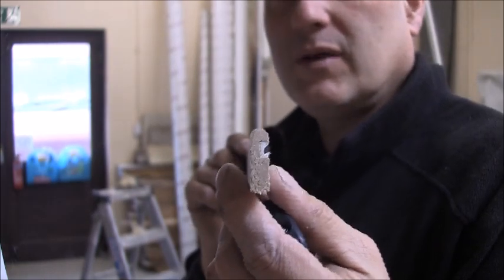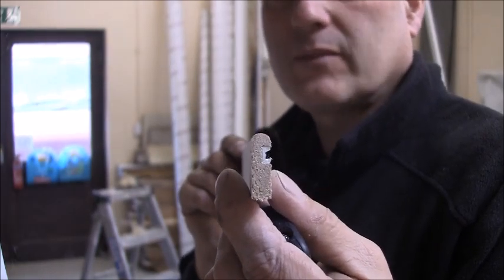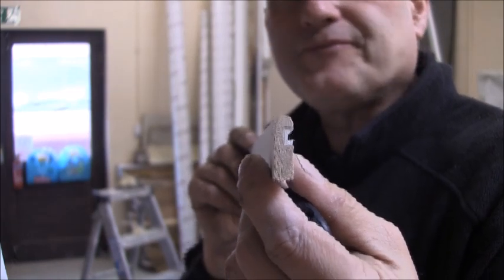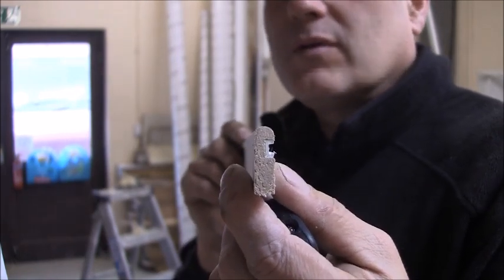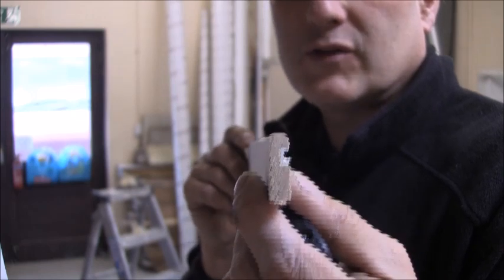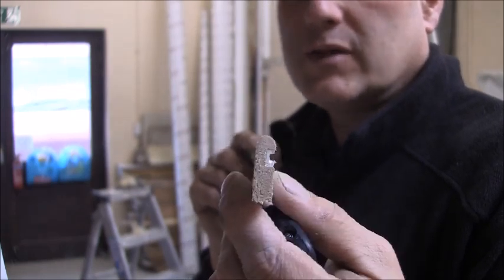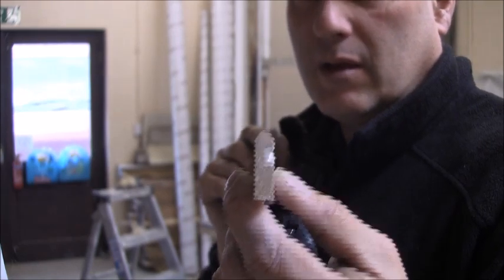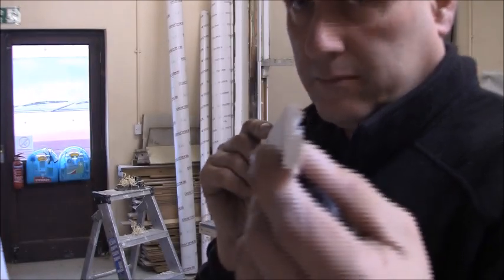I have seen people do it with nail guns and God knows what. And what tends to happen is it splits, and then there's a lot of swearing, a lot of shouting, and you end up redoing it. So experience has told me, always pre-drill it. Then you've got a good job.